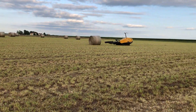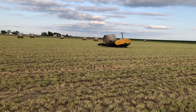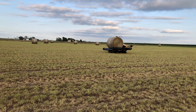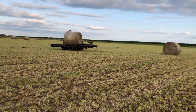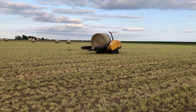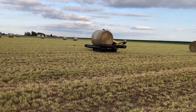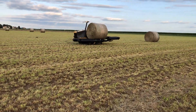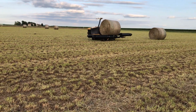The sensor width is known, and Edmund DuPont helped develop the overlap calculation so that running the line means the entire area has been canvassed. If it looks like the machine didn't get a bale that was right there, it's because that bale was too far away from its original point at the left. That's programmed in to keep the machine from getting deep inside a bunch of bales and having to avoid and avoid to try to get back. Best practice is to move from the outside of the perimeter inward to clear bales the cleanest way, with no obstacles on the way to the unload stack.